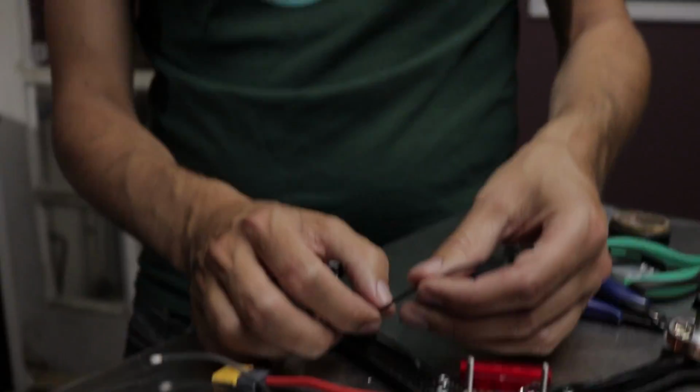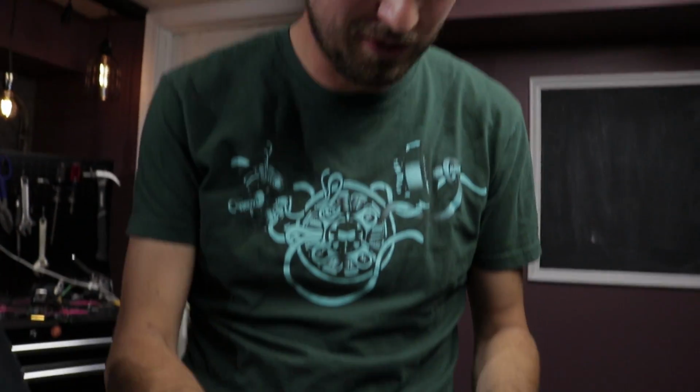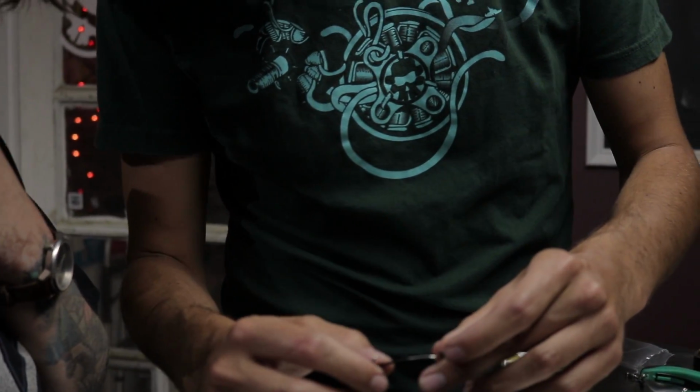Go into all of that, like all into the weave? Yeah, and so then once it's in, I mean, NASA would tell you it's not a strong joint, and once in the rocket, so if you're ever soldering for NASA, don't do that. They want you to do like this crazy weaving thing. Right. But for a mini quad, yeah, just mash it together, heat it up, just get a little piece of heat shrink right there. Slide that over.